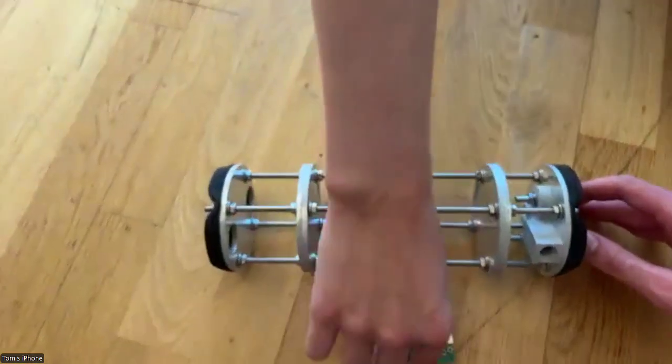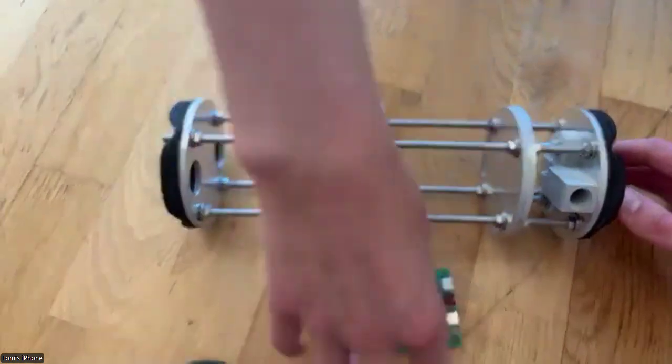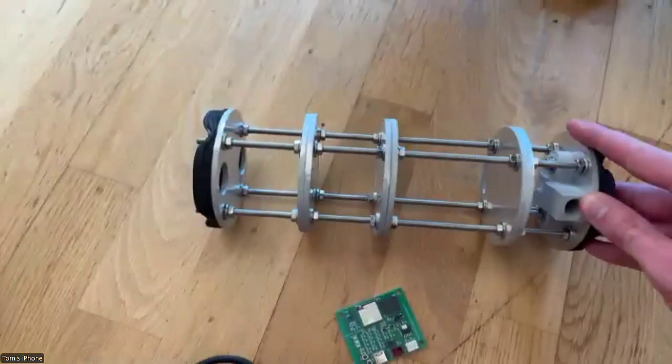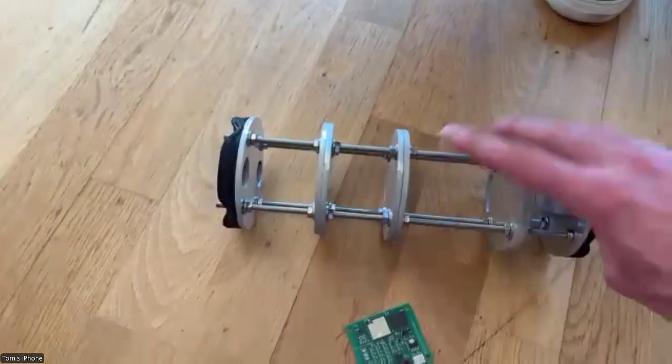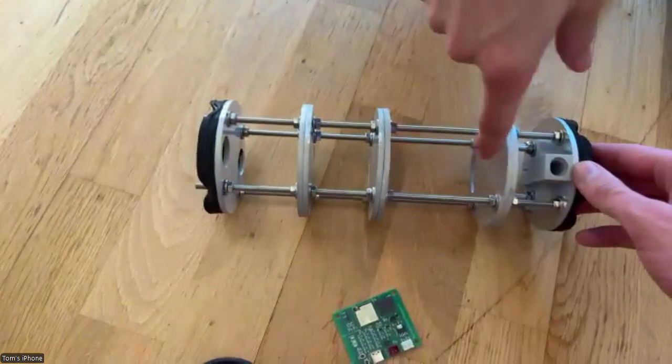Okay. And that little board that you're using for your measurements, how are you going to mount that within your payload structure? Mounting within the structure, I believe it just goes on one of these shelves here. Okay, so it's just going to sit orthogonal to the direction of thrust. Yes. Okay. And what kind of battery do you got in there? Again, 3.7 volt lithium ion, 3000 milliamp hours. Okay, and you're just gonna mount that on the bulkhead? Yes. Within one of these shelves, probably.